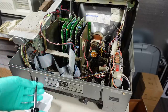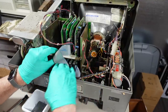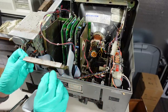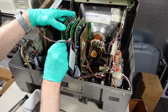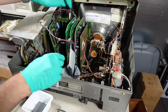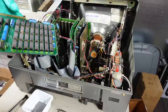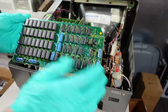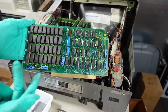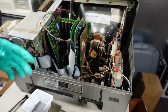I don't want to drop these things inside. There we go - the bar comes out. It's quite dirty, got some foam and plastic on the top, and there are a lot of spiders. Going to start with the boards. I'm going to leave the first one because it's connected - let's pull off the next one. This looks to be 4116 chips, so this is going to be 64 kilobytes of RAM. I'm imagining it's possible to install multiple of these and maybe expand this thing beyond the 64K that's probably in this machine.